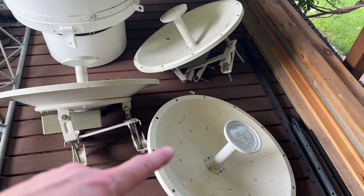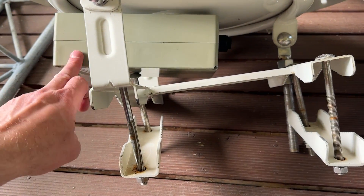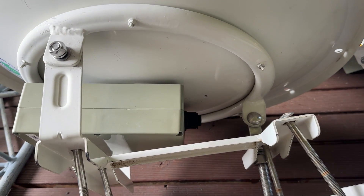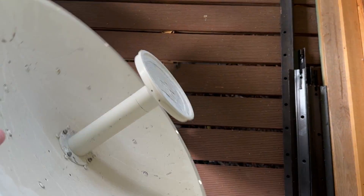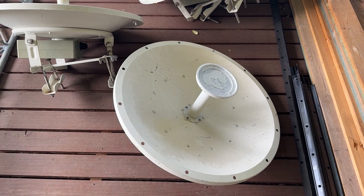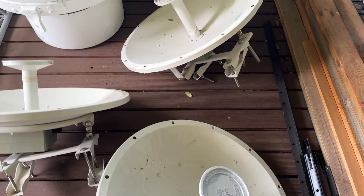I've also got three 5-gig dishes. These are Rockets — they were used for point-to-point links. You can see there's a box mounted on the back behind where the feed is, and I need to get some new boxes for starters. We've got 5.8 gigahertz transverters coming from SG Labs, which we're going to get on the 5.8 gigahertz band — mount them in the back here and this will make a good way of getting on the 5.8 or 6 centimeter band. The only thing is I don't know how much power these dishes or the feeds can handle. I found on AliExpress some Chinese amplifiers that'll do up to 100 watts, with a 50-watt version available. I'm not sure if the dishes or the feeds can actually handle the power, so we might end up hooking it up to one of these and see if we can melt the feed.